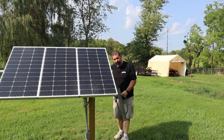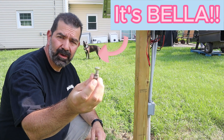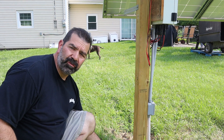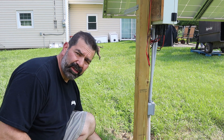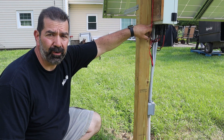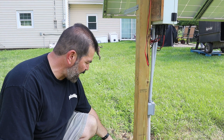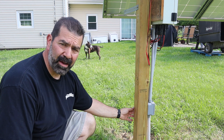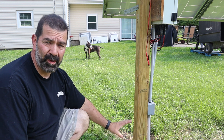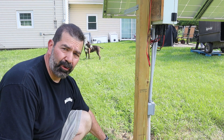I just left a little nub. So what we got here is a ground clamp — I'm gonna put it on this ground rod I just drove into the ground. I'll take some pictures of this up close so you can see it. I also have a ground connection in this box. I'm gonna hook this wire up, run it down outside, get some nice wire clamps to make it look good, and then connect it to ground so my whole system will be grounded.